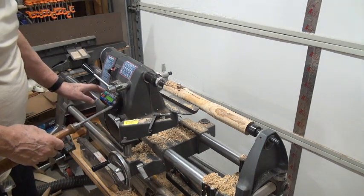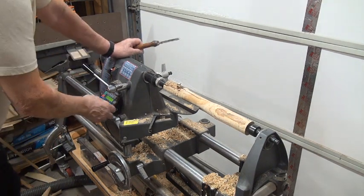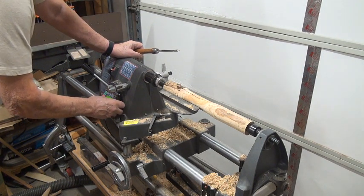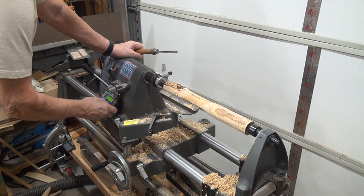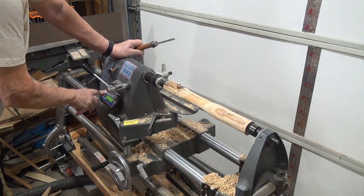I've got it set up already for turning with a Craftsman carbide tool. Right now it's at 500 RPM. I'm going to reset it by going back to menu, taking it up to lathe, confirming it's about two inches in diameter, confirming it's hardwood — now it's going to go at 950 RPM.